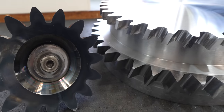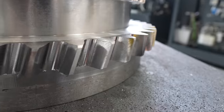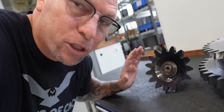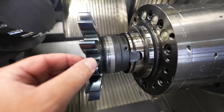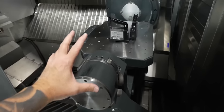They've got different tools but they're actually making their own tools. So that's a tool for power skiving and this tool actually cuts gears. Check these out — big, big gears, all different sizes. This is a custom tool for this application to cut these gears right here. We're going to show it in the machine. When you get a machine like the HF5500, power skiving is an option you can add to make gears — just another thing you can do.